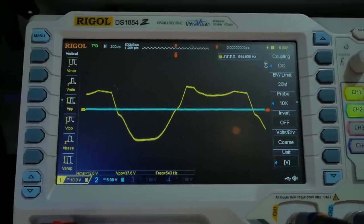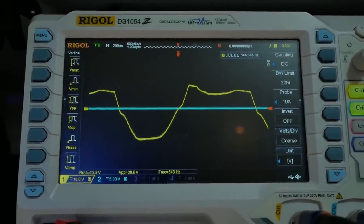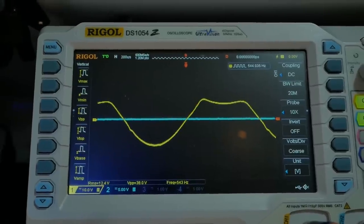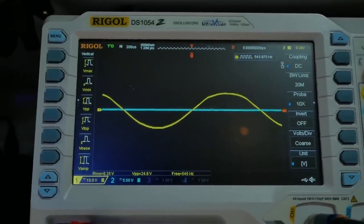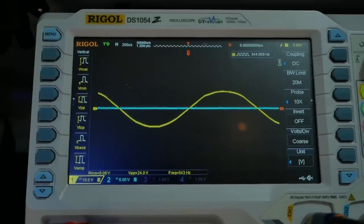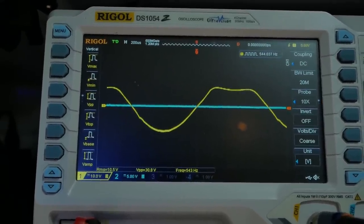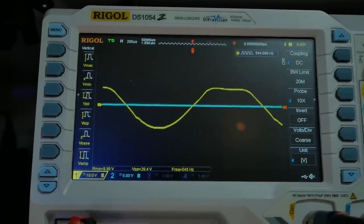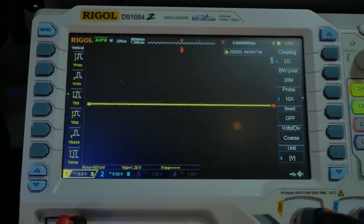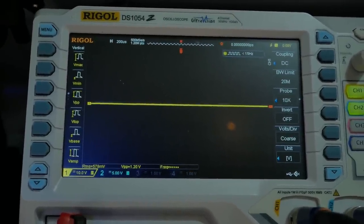And yeah, sure enough, it's got that weird dip happening halfway through there, and the harder you push it, the more terrible it sounds, and the output power isn't like it's at the start of that distortion. You can see down there, it's only pulling about 8 volts RMS across 8 ohms. You push it, it's pretty bad at around 9 volts. So it's limiting how far we can push the output stage before it starts giving that horrible distortion.